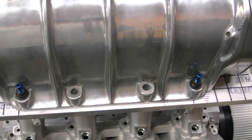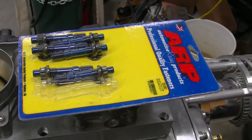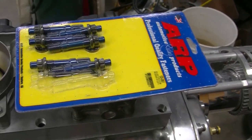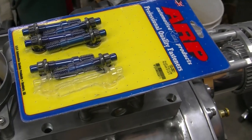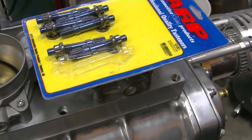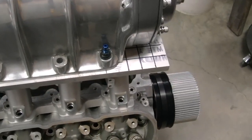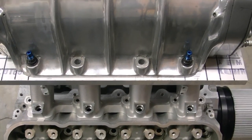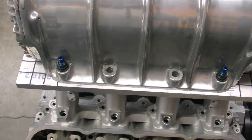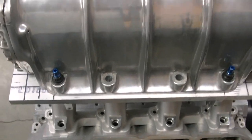Tomorrow I'm going to try and finish this up. When you put a blower on an engine like this, you need to use aluminum studs. They're kind of expensive, but blowers are more expensive. When you backfire a motor, hopefully it all goes out the burst panel — which I have yet to make — but if it doesn't, if you have too much back pressure, it'll blow the blower apart. You need it to blow the blower off the plate; that's why they make them out of aluminum. I'll also have a blower restraint running across the top. It's still required to run aluminum blower studs even if you have a burst panel or one of those spring reset devices.